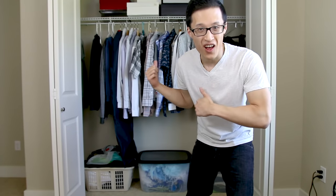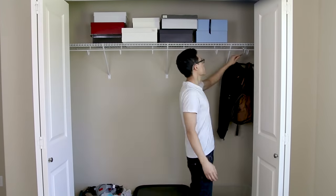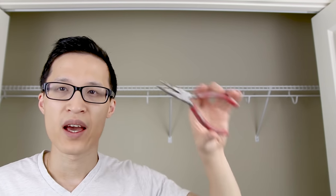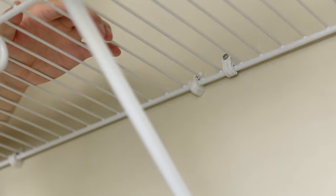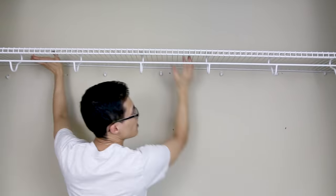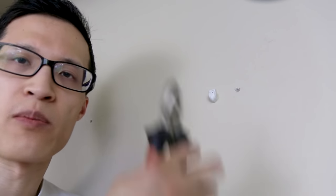Today I'm going to remodel my closet and get it organized using the Espresso Premiere Tower Kit from Martha Stewart Living. First, time to clean out the closet. These closet shelves and racks are really standard in a lot of new home builds and you just need a pair of pliers to uninstall them. There's a nail inside each anchor holding it to the wall — pull out the nail with pliers and it should come loose. Once you get the nails out of the anchors, you can pull them out with the pliers.